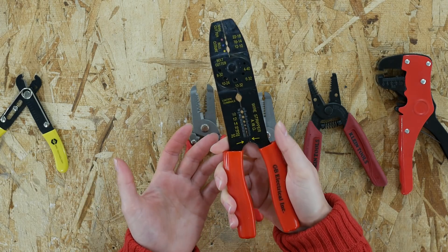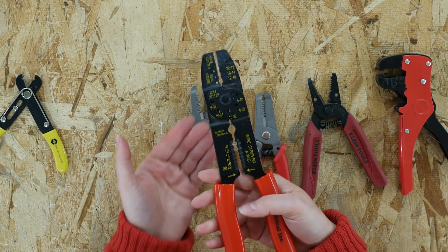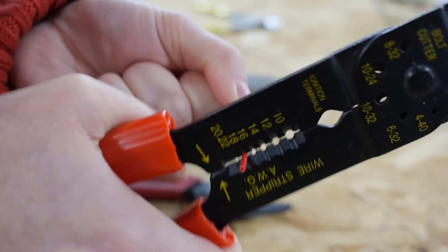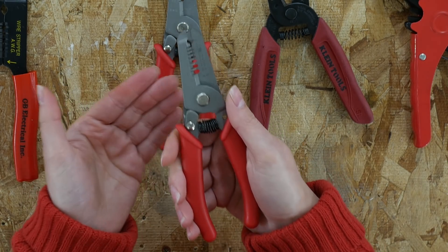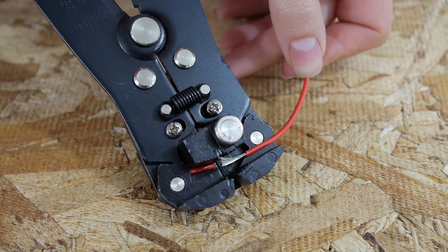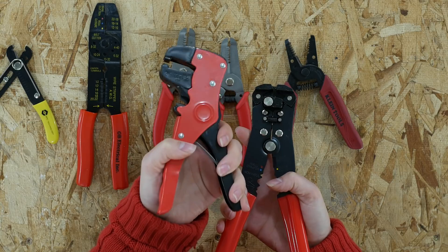This type can also be found fairly inexpensively, but the wire strippers are on the handle which is not great ergonomically. These are meant as a multi-tool where you can cut wire, crimp connectors, and cut bolts, but as wire strippers they don't work very well so I don't really recommend them. We talked about how wire comes in different gauges — so do these types of wire strippers, so make sure you get a pair that has the gauge sizes you're going to need. This last type works by pinching the insulation and pulling it off of the metal wire inside. This one works really well on ends but sometimes it accidentally cuts some of the strands off, which is obviously not desirable.